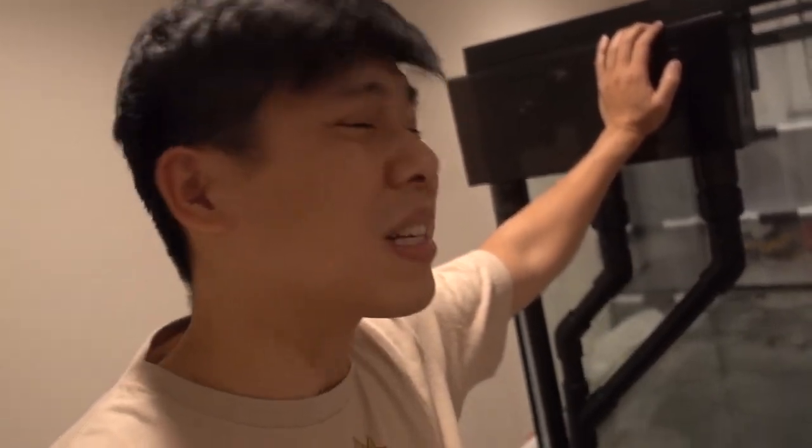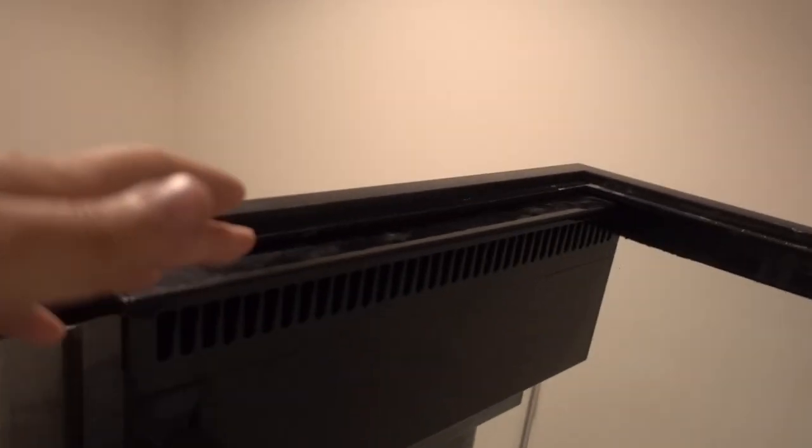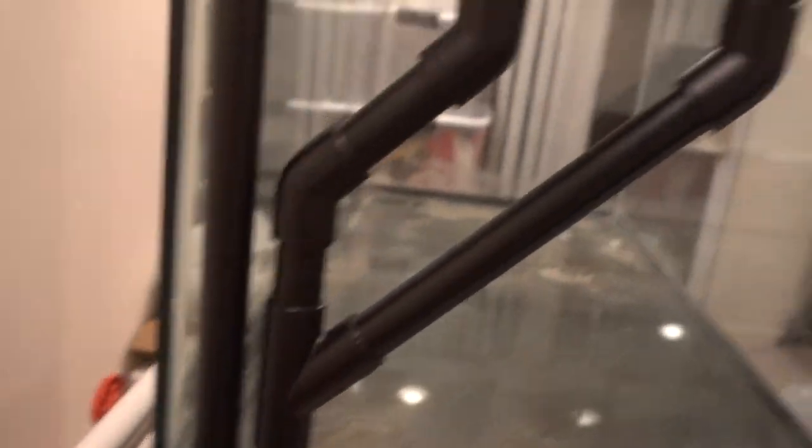To be completely honest, they are not wrong. At some point after this setup I thought, okay, three drains, three pipes — there's a reason why that's standard. But I talked more with my reef sensei Telegram, and he provided a solution that also makes sense even in this configuration. I pointed out how likely would this drain actually get clogged — because for water to enter the overflow box it has to go through really fine rear grids, and you could also add mesh over the emergency for extra safety. The likelihood of something entering and clogging that pipe is almost nil.